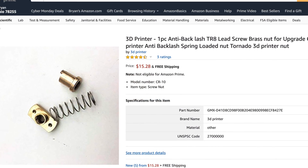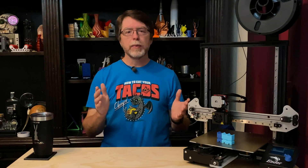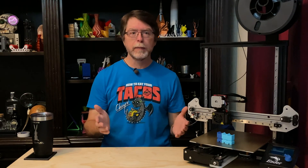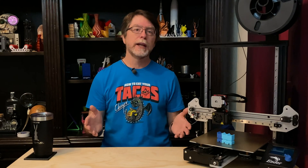Creality has their own special size for anti-backlash nuts because the stepper motor is so close to where the anti-backlash nut would be installed. I've only found one supplier on Amazon and they take forever to get and they're kind of pricey. Since I don't want the X-gantry coming into contact with the finished print, I've installed a generic anti-backlash nut along with a printed adapter to make it fit. The generic part works in this instance because the extruder stepper motor has been moved over to the X-carriage. On an Ender 3 or Ender 3 Pro with the Bowden-style extruder, if you want an anti-backlash nut, you'll need the Creality-sized one. I talked to Cody about this and he's looking into carrying the Creality-sized anti-backlash nuts in the future. In the meantime, I have Amazon links in the description for the Creality-sized ones and the generic brass one I'm using, as well as a link to the Delrin ones that 3D Fuse sells, and a link to the adapter I found on Thingiverse. I do recommend installing one of these if you find that the X-gantry is sinking to the bed when the Z-axis motor is no longer powered.